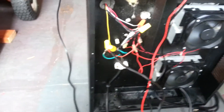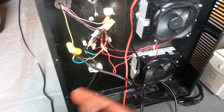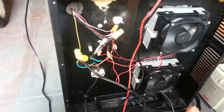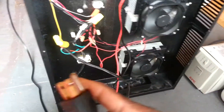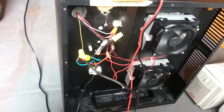In case you have a Black & Decker thermoelectric refrigerator and the power supply dies like mine, you can certainly bypass the power supply — you don't have to buy another one. Just convert it to DC by connecting all the red wires together and all the black wires together, then connect it to a DC source such as solar or a battery bank. All thermoelectric refrigerators run off DC; the store-bought power supply just converts AC to DC, and you don't really need it. I hope this helps someone — thanks for watching.